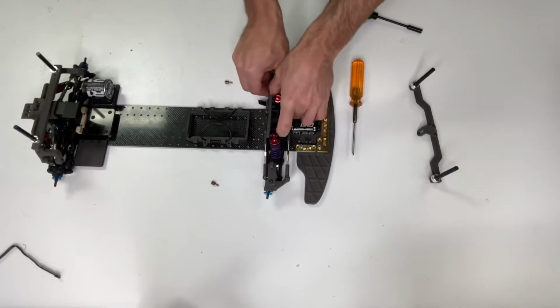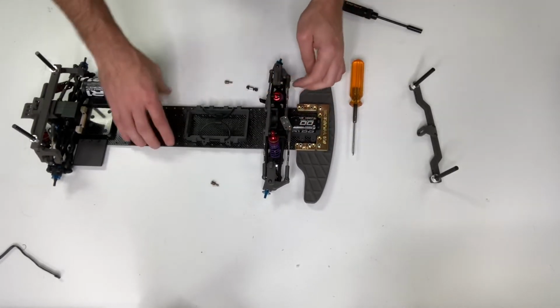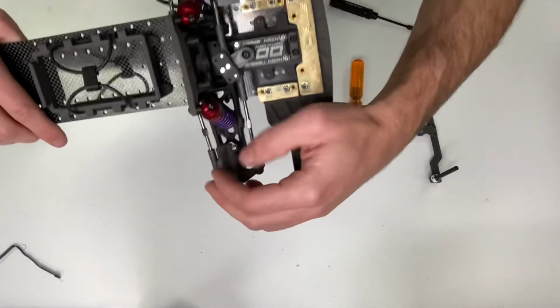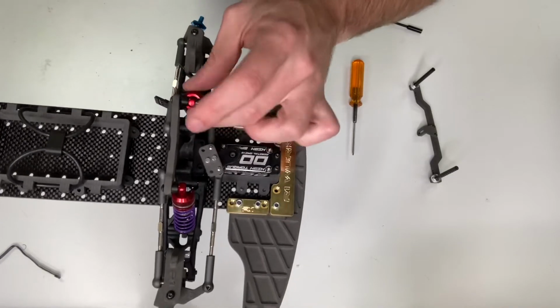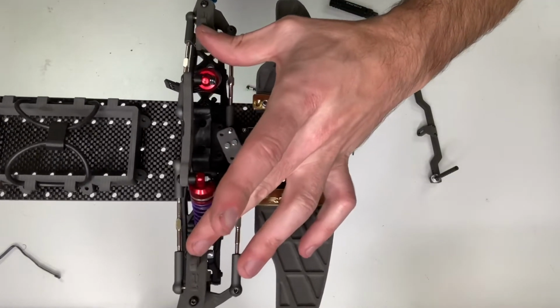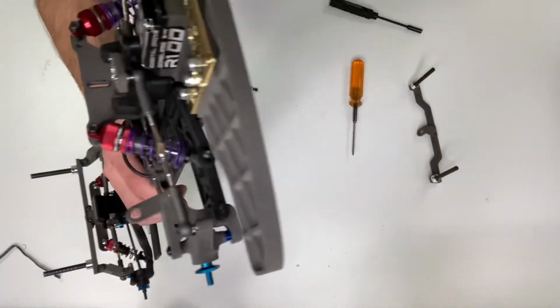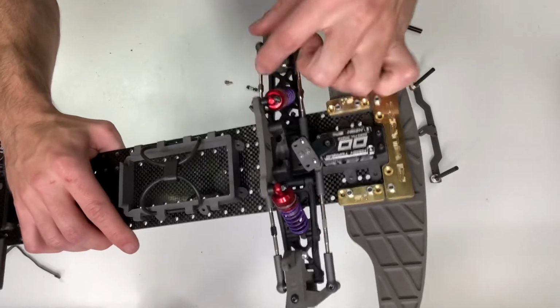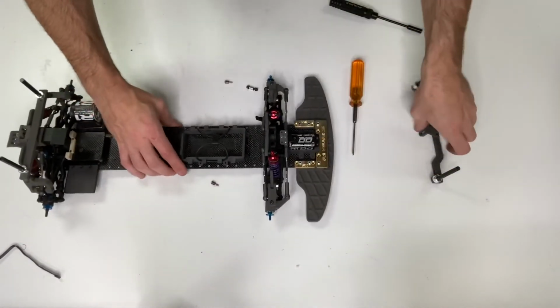All right, as you can see here, there's going to be an overlap or a mismatch. I had the little risers falling down, but when I put the damper in, it makes it a little difficult. So when you put your dampers in, make sure the risers are clear and free, facing upwards.